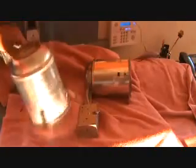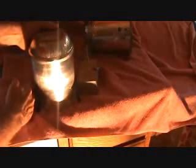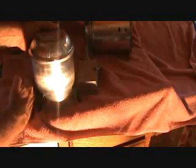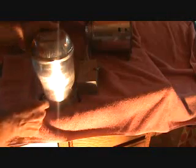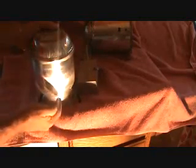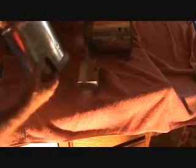Okay, because when I look at these cans here, you see the prongs, we've got these prongs here that come out on the side. So here's where the ceiling joist would be, and these tabs can come really super close to the joist, about a 1/2 inch away. I'm glad they situated them like this, and they did that for a reason. Had they run one over here and one there and one straight across, you'd have to move it away from your ceiling joist further. So I know I need about a 1/2 inch gap there for those little prongs to work.